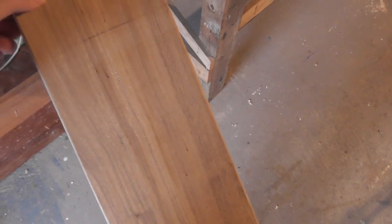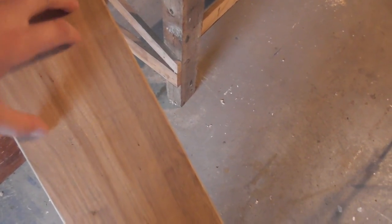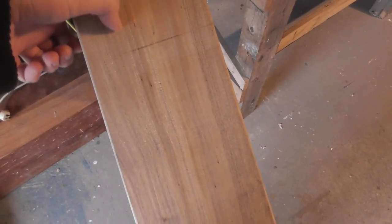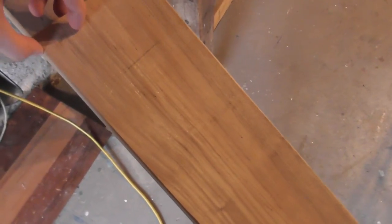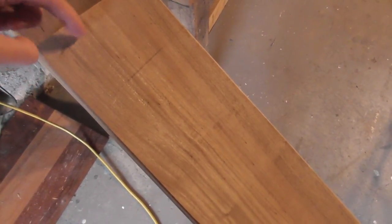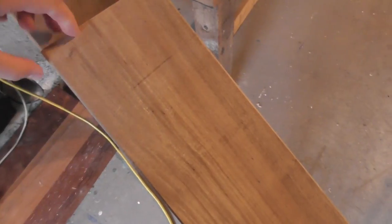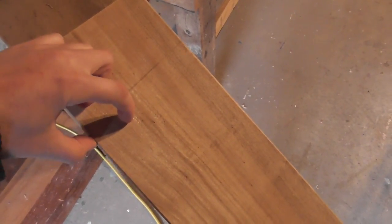Now, I want it flat, square edged all the way around on the top and the bottom, so I really need to cut the edge off before I start. But I have another job I'm doing at the same time with some railings, which are the same size, thankfully, and they need to be rounded all the way around. So I can just round over that already rounded edge, so I don't need to change the saw size. I can just rip them all at 40. The first cut I will use for the railing job, the next two cuts I use for my tabletop.